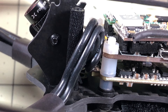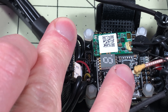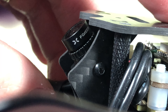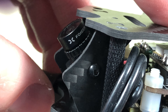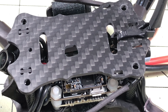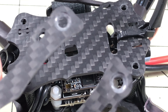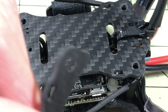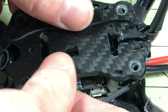Just tighten up all the screws, put the top back on, and go find out. Once I put the top on I found I've actually got more than I want — more like 60 degrees — so that's probably too much, but I'm going to try it. One thing to note when putting the top plate back on: the plates are directional. They are beveled to match the screw on one side, so if you try to put them on upside down your screws won't fit. Make sure you put the right plate on the right side.